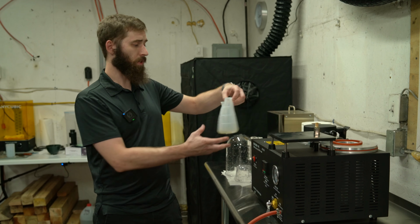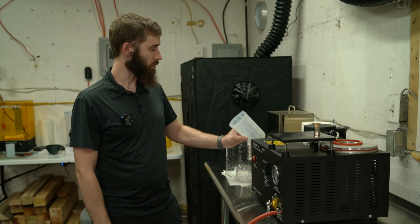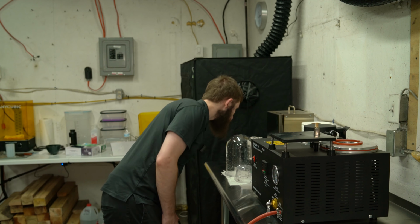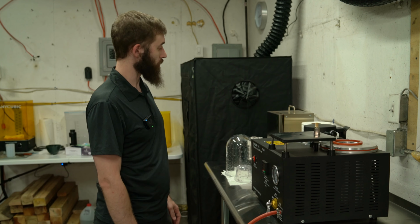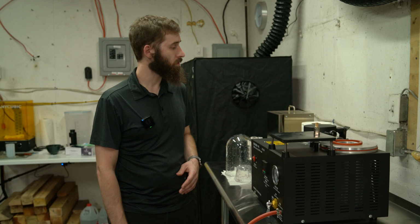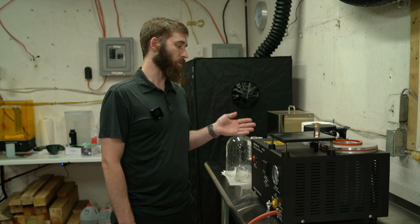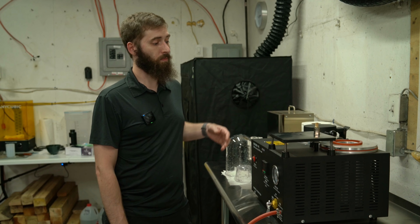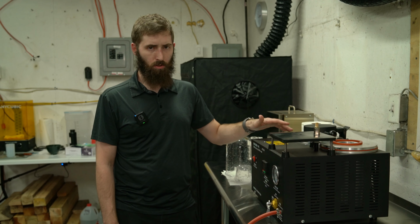I had a little bit of investment left over in the beaker, so I didn't need all of it. I mean, it set up pretty quick already. I'm gonna clean that up tomorrow and then burn it out and cast it. I got a 13-hour burnout cycle programmed into my oven. And then during that, while that's going, I'm gonna do the preheat cycle on the crucible.